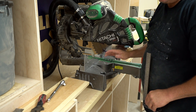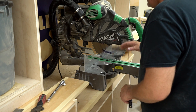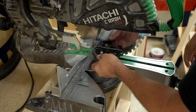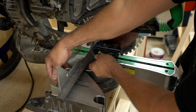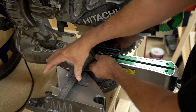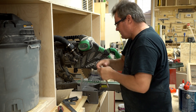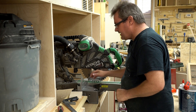I can do further adjustments later when I do an actual cut and check it, but for now it's good — it'll allow me to get this fence lined up. I take my combination square, put it up against the blade making sure it's not touching any teeth, slide it back until it contacts the fence, and then push the fence until it lines up with the blade of the square. I'm really only trying to get this close. Now that the fence is close, I'm going to tighten the furthermost bolt — the fence will still be able to pivot forward or back as needed.